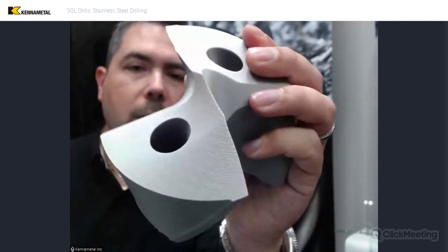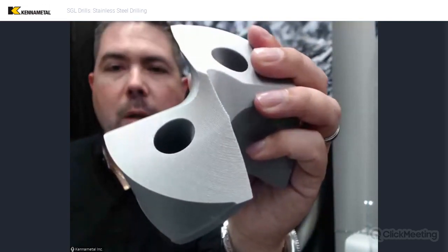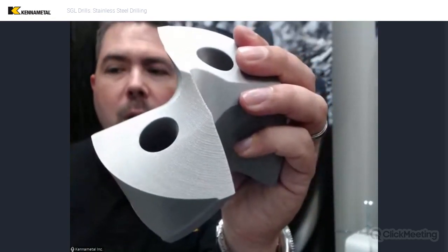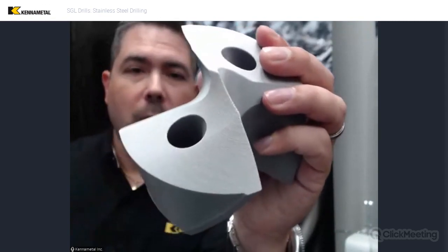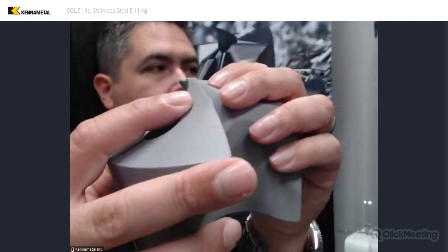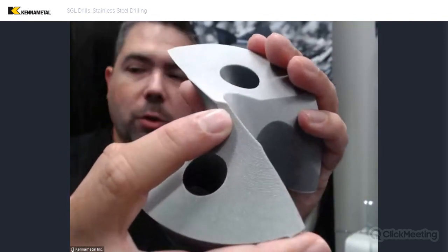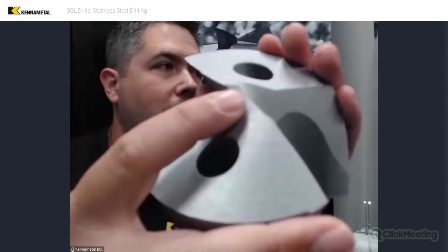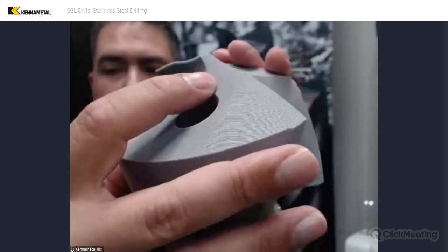When we think about forces, there are a lot of different ways to analyze drilling force, but a lot of tried-and-true basic formulas suggest that about 70% or so of the thrust forces in drilling come from the size of this chisel area. That chisel is just at this cross section in the middle, right where my fingers show. A lot of that is because we've got a zero speed condition right there.